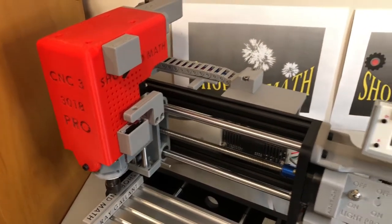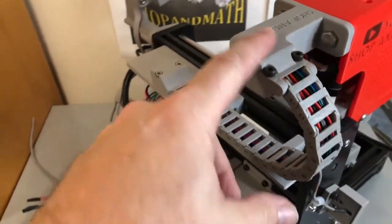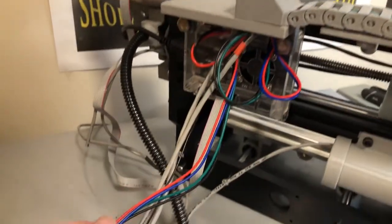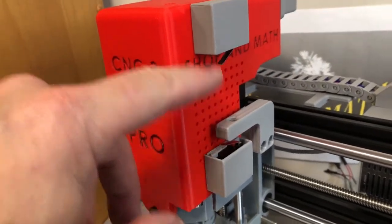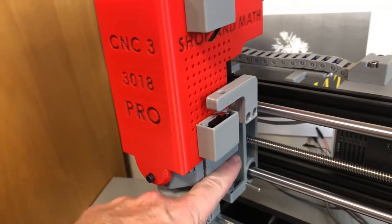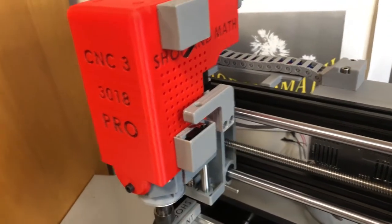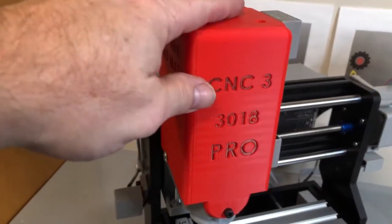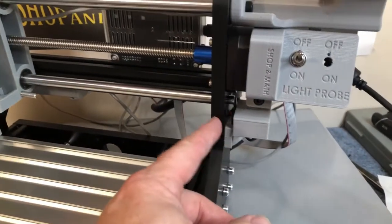Some of the other things I'm working on — let's take a look at the back here. As you can see there's a nice wire channel here; I was quite surprised how nicely it laid out. It's still a bit of a mess back here but that'll all be cleaned up. My Z micro switches are on the outside, not on the inside, so I'm not going to lose any travel at all. The guys that put the 5 or 6mm button stops inside — that means they're losing 20 to 30 percent of the travel. I didn't want to do that. You can see the shroud on the outside, and we have our micro switches on the outside.